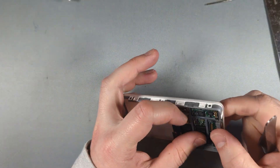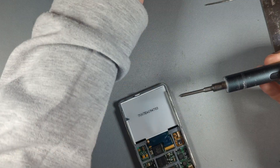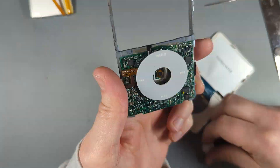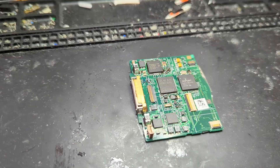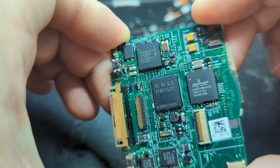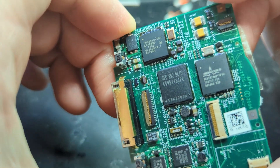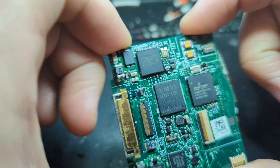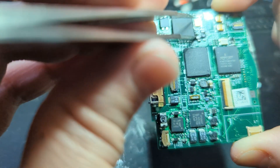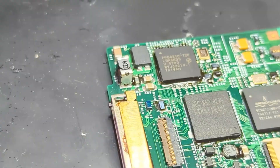I'll film the disassembly as well. We want to get the iPod fully disassembled for something like this. First thing — as you can see, there's a bunch of underfill in that area, like a rubbery sort of substance. We've got to pull that off first. We can heat it up to not very hot — about 120 degrees Celsius — and then just scrape around it and it'll come off pretty easily.